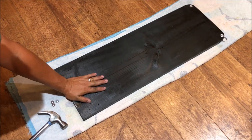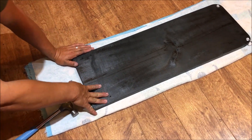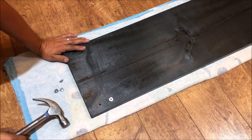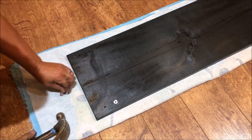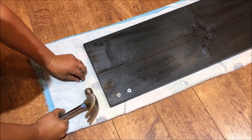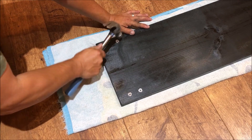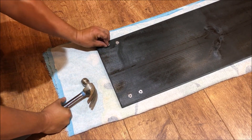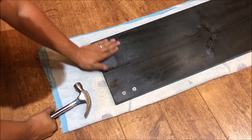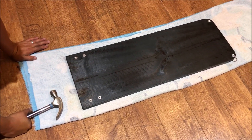Here I am on my kitchen floor working on a towel. This has to be upside down — basically there's a top and this is the bottom. Go ahead and put the T-nut in here and hammer it in so that it's flush. You do that to both portions of the motor mount — this is the base, and then you have the transom as well. The transom is the part at a 90-degree angle — the part the actual motor attaches to. A couple taps like that keeps it pretty flush, and also do that to the transom after.